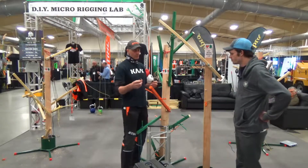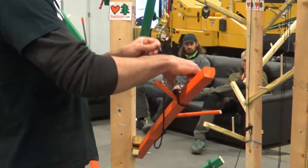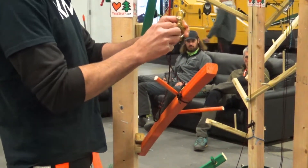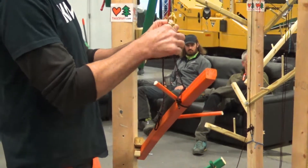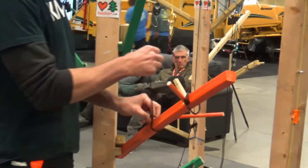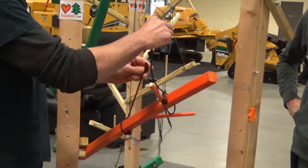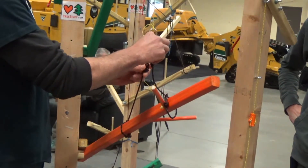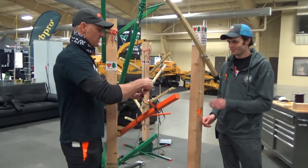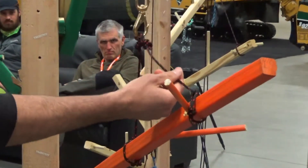A simple way to look at it is you're going to use one sling on each end of this leader and hook it back to the crane. As soon as we do this, you're going to notice a little bit of a problem. We're going to try to balance it out to where they're equal in distance from the center point so the angle is right — and you notice it doesn't meet back. So a lot of times we have to pull that crane back down, cable down a little bit, pull it back up, and look what we have: one tight and one not tight.